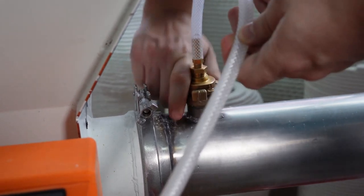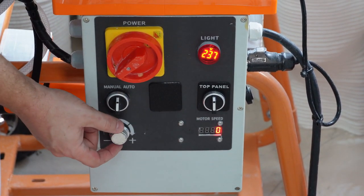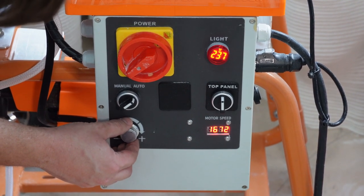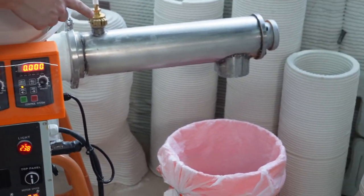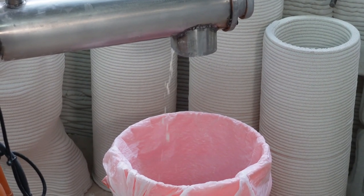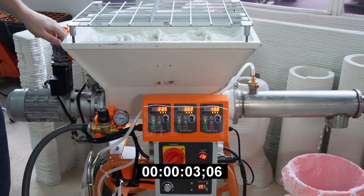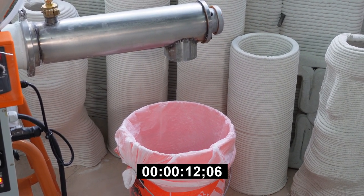With the water system primed and the pressure set to 20 psi, we can now attach the water hose to the mixing chamber and start the system. We want to set the mixer to 2000 rpm. Turn the switch to auto and then turn the speed knob up until the display is close to 2000 — it is acceptable as long as it is within plus or minus 100 rpm. Once up to speed, turn on the water and wait until it is coming out. You can then turn on the hopper agitator and the cement powder motor. These numbers represent the motor rpm. You should start with the water set to a higher setting and then bring it back down to your desired amount. For Cica 752 cement being used as a 2k material, we have the water set to 235 and the powder set to 130. It can take up to two minutes for cement of a consistent water mixture ratio to come out.